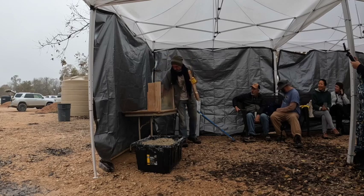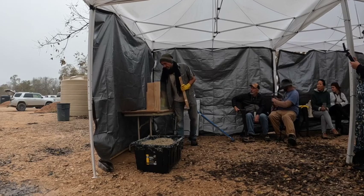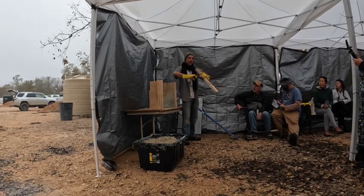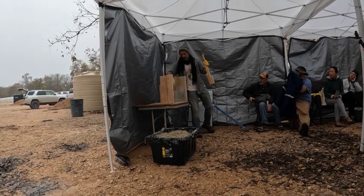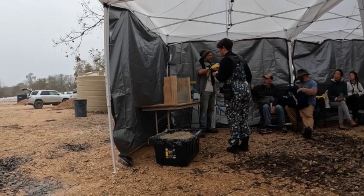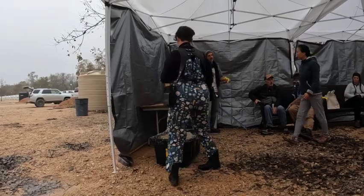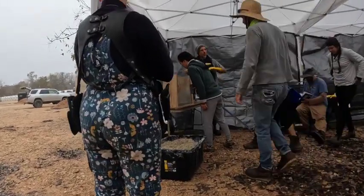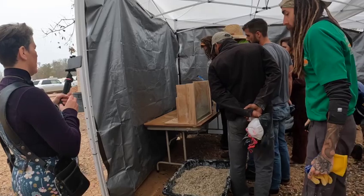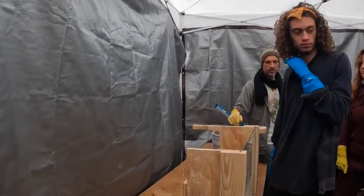And then the middle, all you need to do is put a bit of weight on it, use your body weight, just to fix it in place. What you want to see visually, when you put that layer of hempcrete in, is that the middle bit is almost like a key. Come check it out. You don't want it to be flush; you don't want the whole thing to be flat. That middle section, when you put it in, should be raised, and then you tamp the edges and compress. Once you've had a look, maybe walk past so someone else can come check it out.